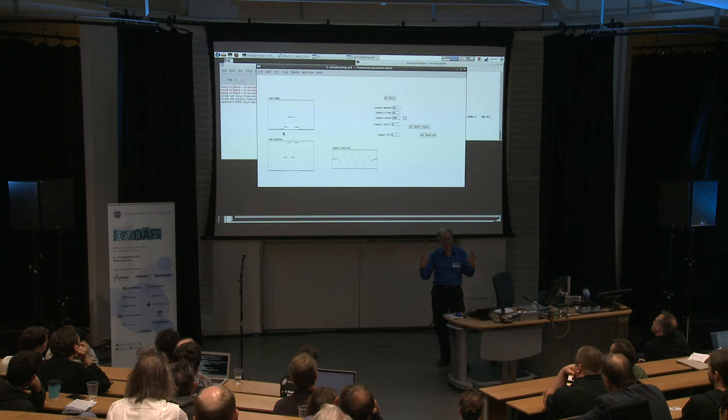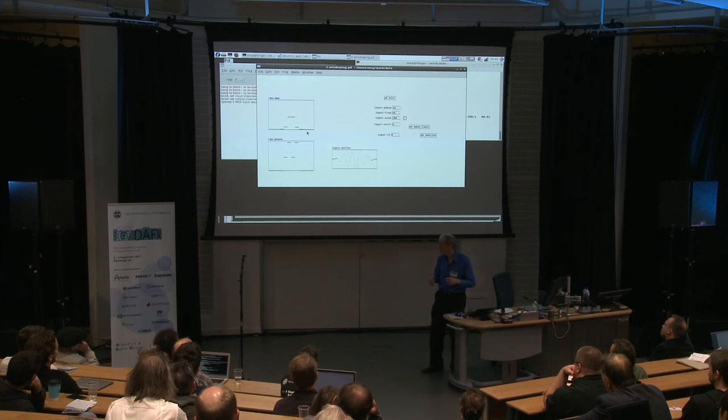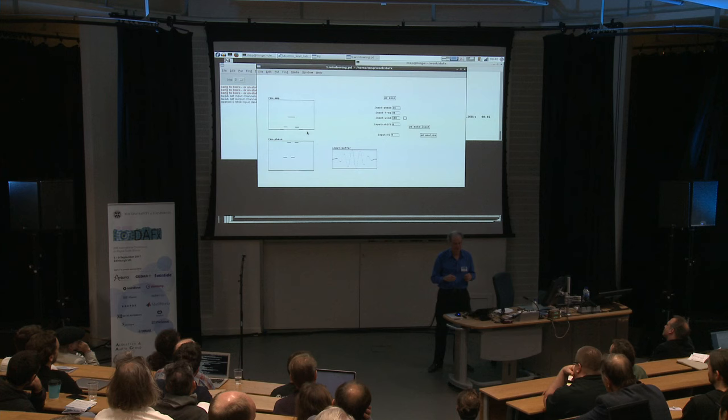But you only see three if you align it perfectly, but in the general case, you see four numbers light up. And you also see a little bit of garbage outside there that is something like minus 33 dB down or something like that, which for my purposes, I usually ignore, because usually there's something a great deal more disturbing than that going on. But some of you will care about that and have to deal with, you know, Blackman or something.